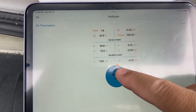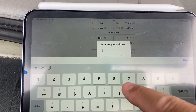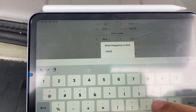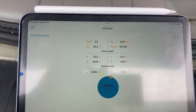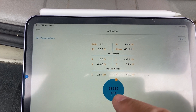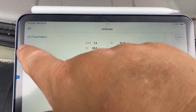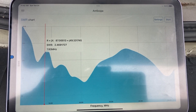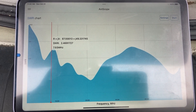Let's go to 10 meters — 28 MHz. The impedance is a little low but the tuner will be able to take care of that. SWR is 2.0 — you barely even need a tuner for that. These results did not happen when I was at the park, but I did put some water on the spike to give it better conductivity. I'm going to try that approach again.